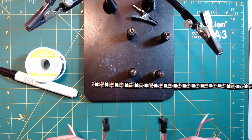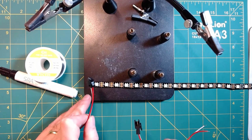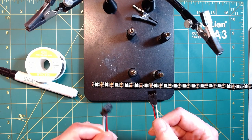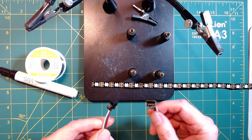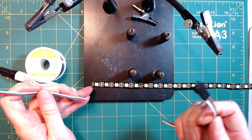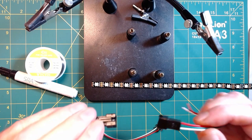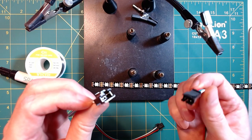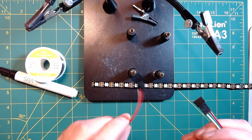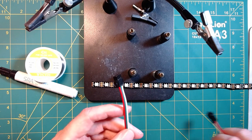While you can certainly solder your wiring from your controller and power supply directly into your LED strip, I highly recommend the use of these JST connectors. It allows you to easily connect and disconnect your LED strip from your controller and power supply should you need to work on it or move anything around. Note that these come in female and male versions, and the standard convention is that you use the female on the data inline and the male on the data outline. If you don't create your own standards, you'll find you end up with two male ends trying to connect together, which isn't going to work.